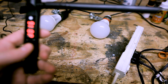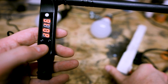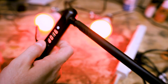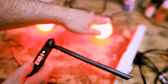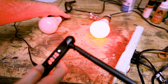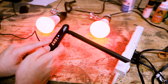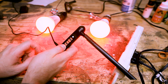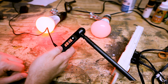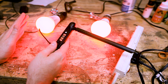So we're going to show you how to un-pair. To un-pair the bulb, you turn it on — same thing — and hit the SET button five times: one, two, three, four, five. It blinks red five times, which means un-paired. Now I'm going to place this bulb on channel one and this bulb on channel two. I turn this bulb on and press SET three times — it's only paired to channel one. Then I switch to channel two on the transmitter, turn the second bulb on, press SET three times — now this bulb is on channel two. It's that easy.